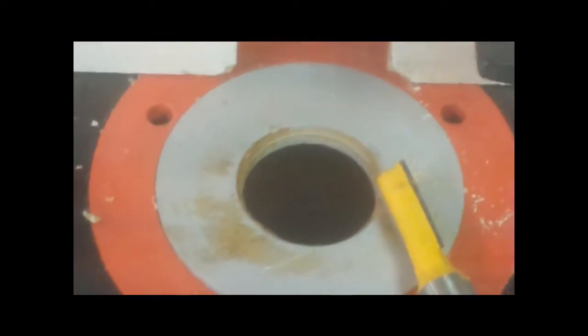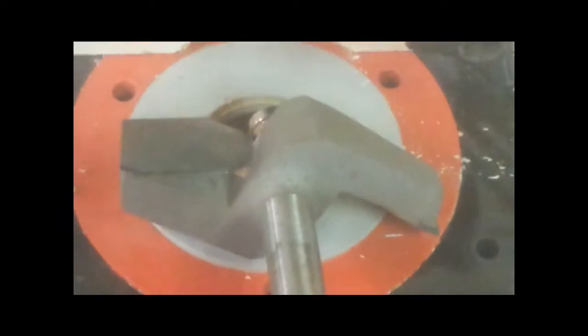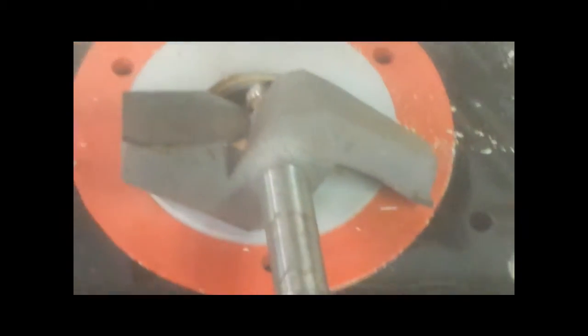Another thing you're going to want is a router plate, and it's not absolutely necessary. You could actually attach your router to the bottom of a piece of wood and have it work. The benefit of the router plate, though, is that you have spaces or circles that you take out, which allows you to put larger router bits in. For example, a small router bit would work in there. However, if you have a large router bit, that obviously isn't going to work. So you have to be able to take the center rings out in order to be able to use the larger bits. So get yourself a good router plate to mount your router onto.